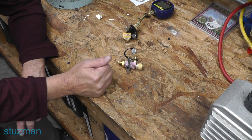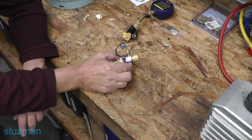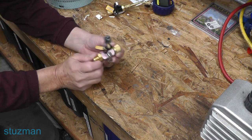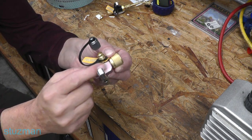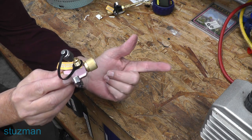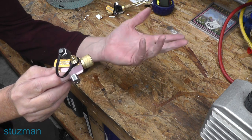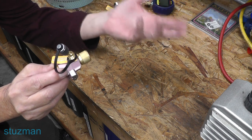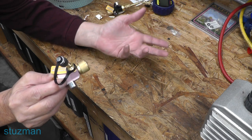One of the questions I got is: why couldn't you just use one valve core removal tool? Now this one is a 5/16ths — it has a violet body and a 5/16ths fitting. On a mini split, the fitting you're going to be connecting to on your service valve is going to be a 5/16ths, versus AC units and heat pumps for home split units, which are going to have a quarter-inch fitting — that's where the black fitting comes in.